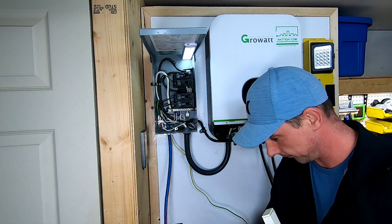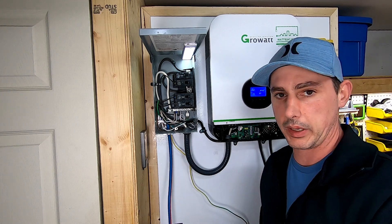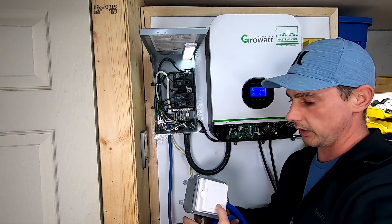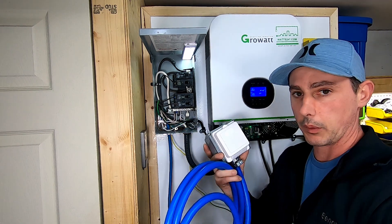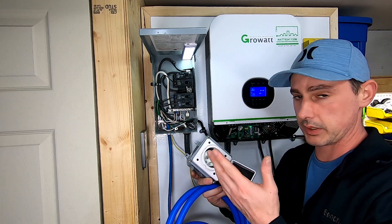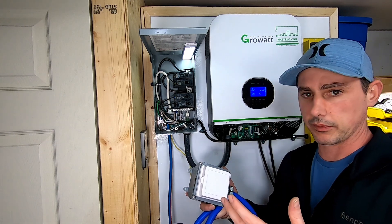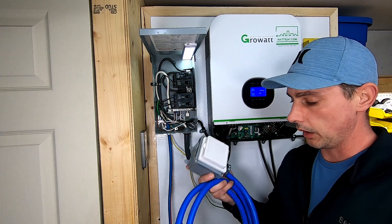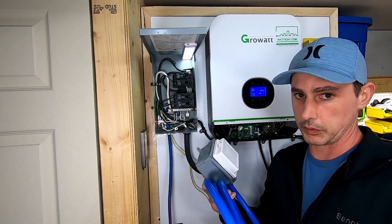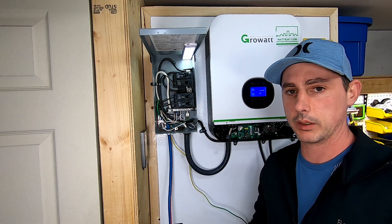That outlet works - you can see the light is on on the GFCI, so that's working perfectly. That's just a quick overview of my AC wiring. Now I'm going to do AC input for my generator, which will be through this big connector here. This is 10-gauge wire and I'm going to have a 30-amp din rail breaker for this coming in - it's a three-prong twist lock 30-amp receptacle. I'll show that in another video. My generator is non-bonded as well, and I will be hooked up to one grounding electrode - my own, not utility, not a house panel. That's my AC wiring video, thanks for watching.